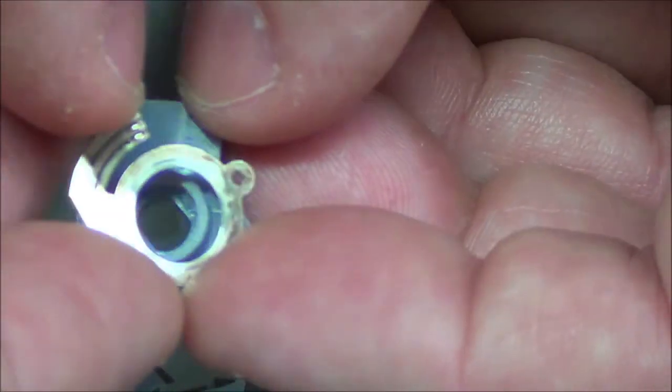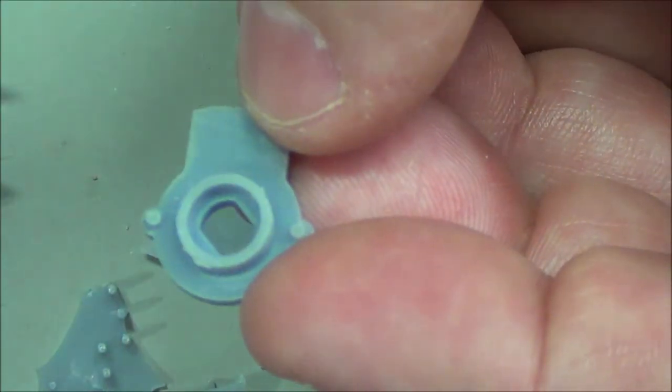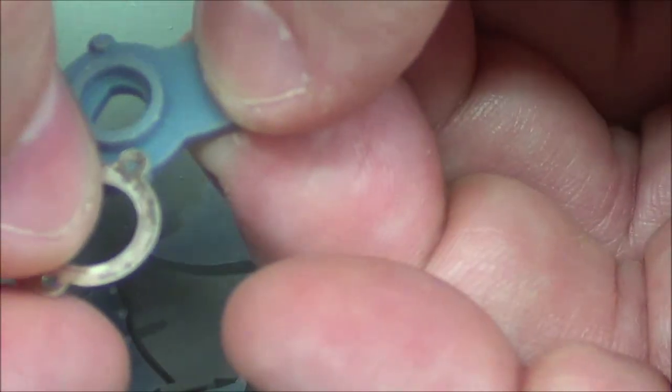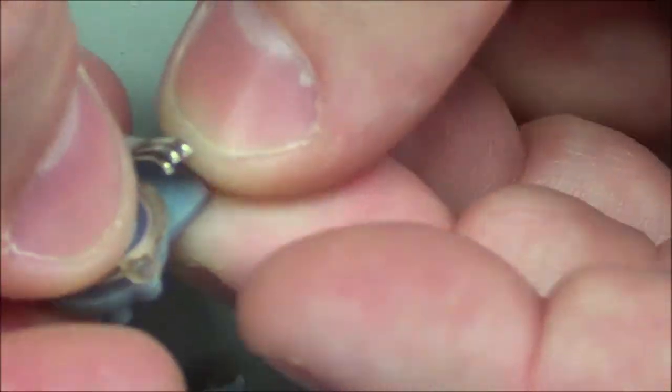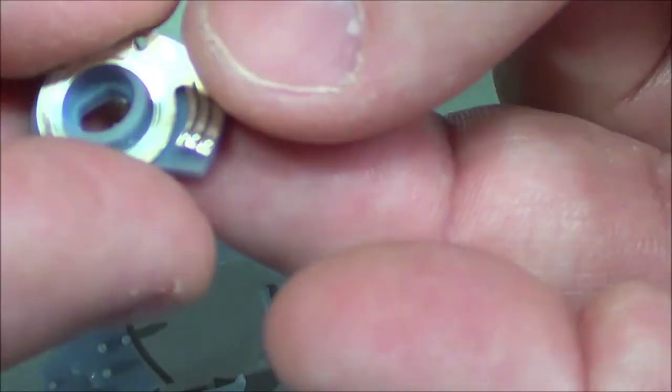I will just modify the original Blender file by selecting these vertices and just tightening them in just a bit on the X and Y axis. And the same thing for the two pins that hold this on it. I don't have that precise of a measuring tool, so I got close. I think everything's in the right position. I just think that it's just a little too wide for the holes that it needs to go through. So, I will not be recording that stuff. I'll just make that change, go to the printer with it, and be back with a hopefully fitting piece.